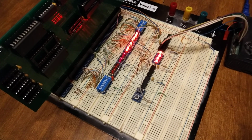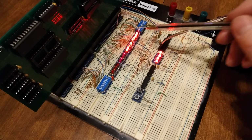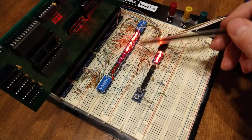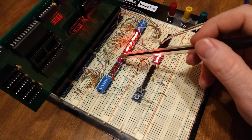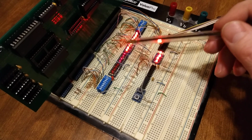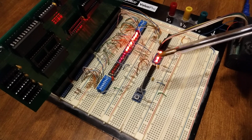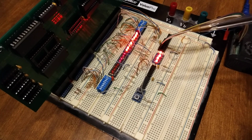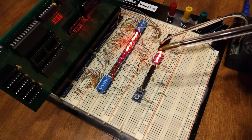So, as you can see, the upper address lines, 8 through 15, are F, FF. And anyway, it's FFF0, and that's correct. The system bus right now is being held, waiting for the ready pin to say I'm ready.